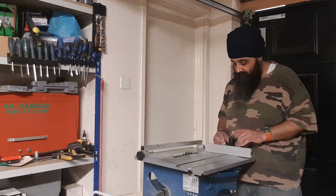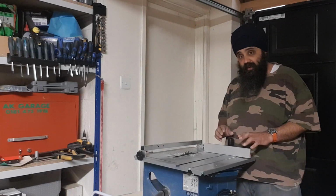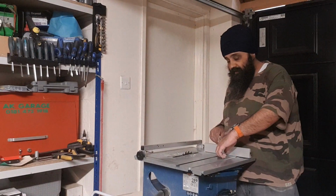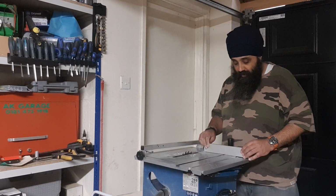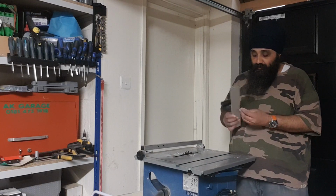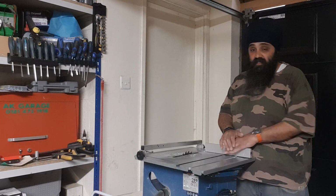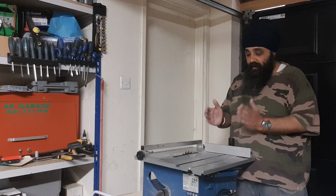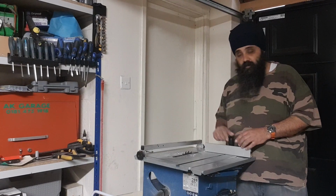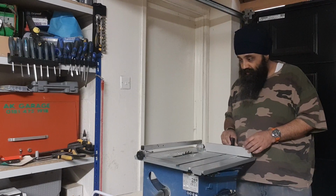However, it got really annoying doing these cross cuts yesterday, and I think I'm going to need to make a better sledge for it. My biggest issue with that is there's only one T-track here, and it's very wobbly. So maybe I can insert a slightly larger piece of plastic into the T-track. So I think I'm going to be, obviously after the Corona lockdown, looking to buy a plastic chopping board, which I can then slice up to make it the right width to slide through the T-track.